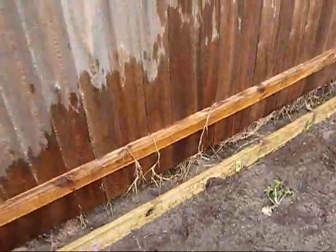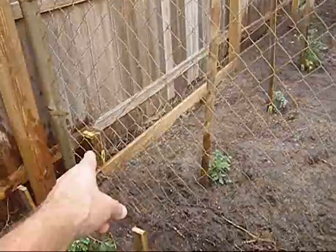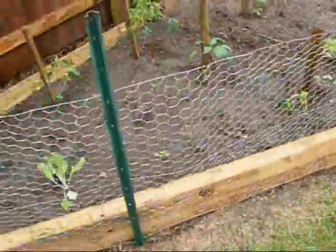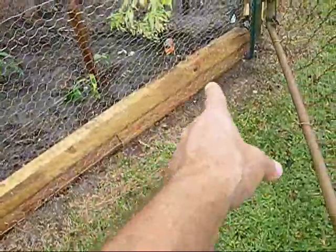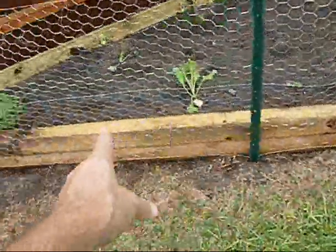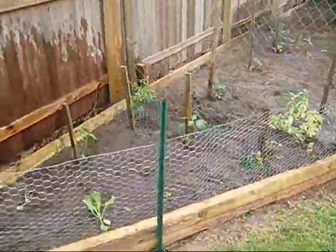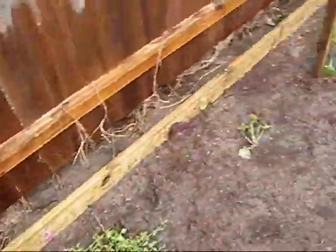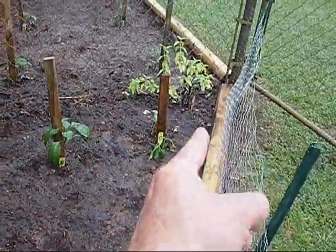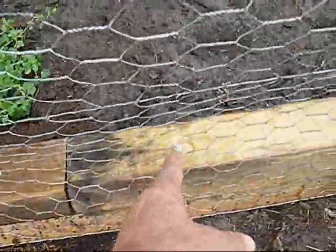You see this construction — I have a backer board, pressure treated wood using the posts from my fence and also adding posts where needed. I used a full length landscape tie and then cut where needed, then a full length across and the same cut on the opposite side to give me my double layer of wall. And of course I have pressure treated stakes pounded in and screwed to it, and wherever there's a joint I have spikes holding it together.